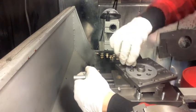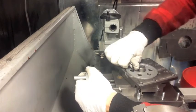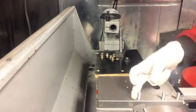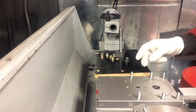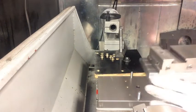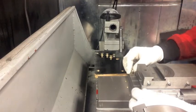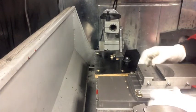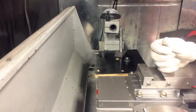I don't know why I waited to tighten this one, but there we go. We've got that done. I simply flip this over. I drilled and tapped four more holes. These two are original and it used to use bolts to hold this down. I've added studs to it and now that goes on there like that. We've got our nuts. The locating pin is what actually holds the compound in place.